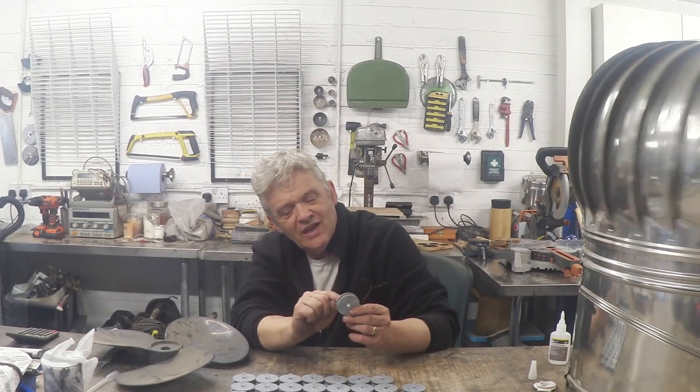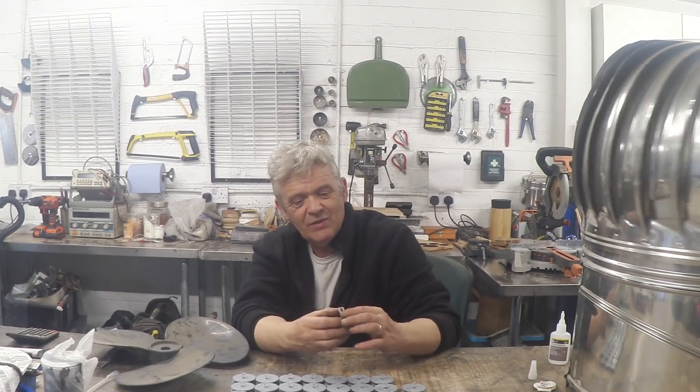This is actually itself a flywheel — there's real mass here, it weighs a few kilos, so once it gets spinning it stays spinning. I want to use that flywheel effect, which is why I haven't put metal cores in the coils. You could put a metal core in, but with a magnet next to metal you get cogging that has to be overcome. I decided the coreless design was the right trade-off, and given we're getting a reasonable output I'm happy with that. I still need to wind the other 31 coils; the magnets are on order so the next video won't be tomorrow, but I will continue this project. Thanks for watching — keep your eyes open for the rest of it.